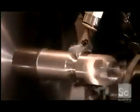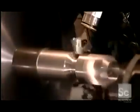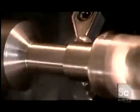After the dovetail cutter sharpens the blades, a tool called a boring bar refines the hole in the center, making it the proper size. Another turning tool now forms the shank, the stem of the plug cutter that you insert into the power tool. Then the cutoff blade slices the tool off.